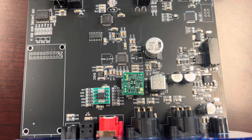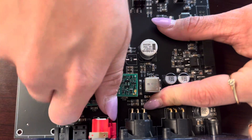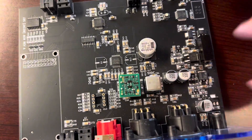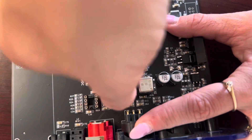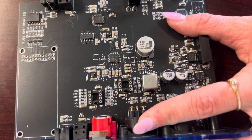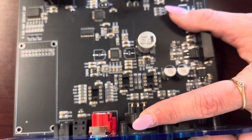Back to the 93 socketed version for removing them. Put a little pressure down on the board, get your finger in there, and pull directly up — not damaging the pins. For this one, I'm going to go on this side where I seem to have more room, pull right up — they come right out. And the Burson V5, same thing, comes right out.